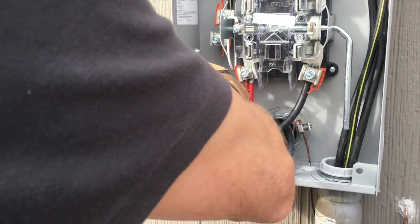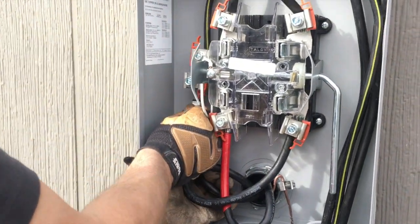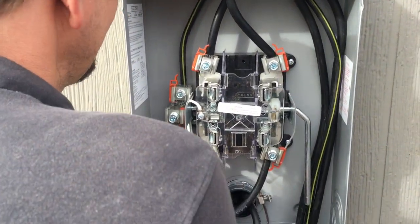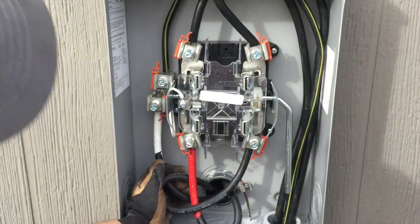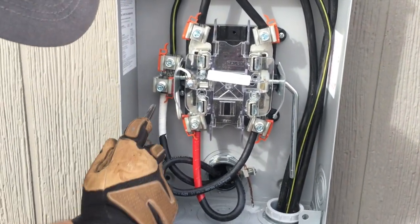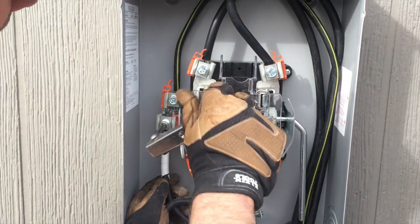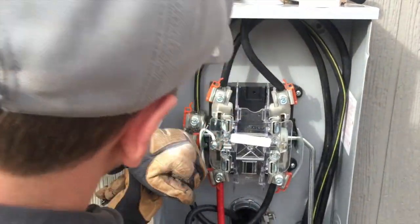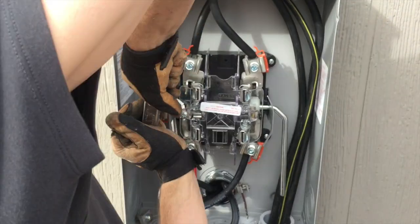This is not a breaker — if you have a breaker, read your manufacturer's instructions. You guys that are squirting deox on your breakers, you sure as hell don't know what you're doing. But when it comes to simple residential, you're gonna want to get that deox on there, and there is a torque specification that we can go through here later.